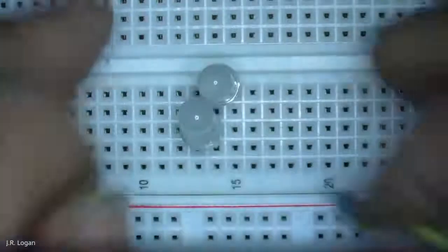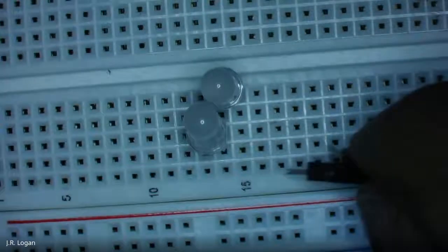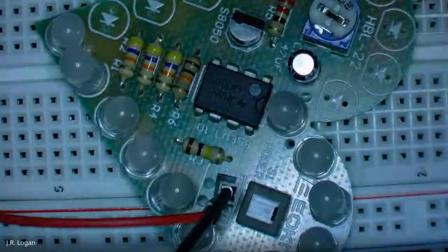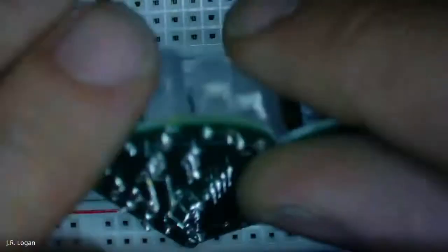And then once you've done a breadboard, what you can do is called a protoboard. A protoboard is just a whole bunch of little spots of copper, copper circles, and pinholes, like a PCB, but with just a regular grid pattern on it. Then you solder your wires connecting that grid pattern to be specifically your board, and you use the through holes to put your through hole components in there. It takes time to produce those, but they're going to be a lot more stable, and they're great for doing prototypes. That's why they're called proto boards, or prototype boards.